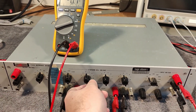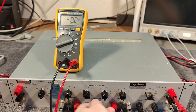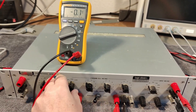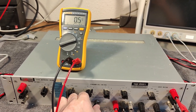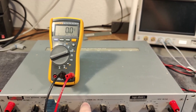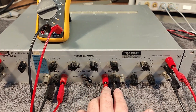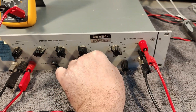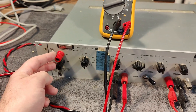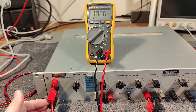I put this in the middle — this way it goes up, and this way it goes down. I need a little bit less. And if this is not enough I should have done it this way... So now I have calibrated my null detector at my known voltage. So if this is correct, and I did not use the other adjustments right here — this 10 volts here — what do you think we have on this output? And this one is in 10 volts. Of course, I got exactly 10 volts coming out. So of course it works.